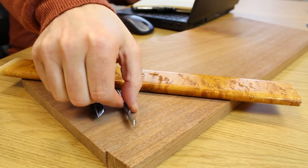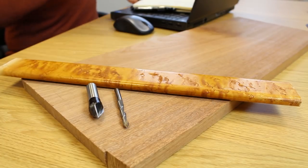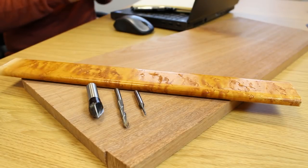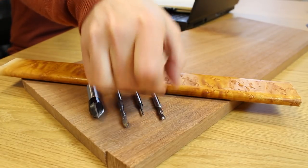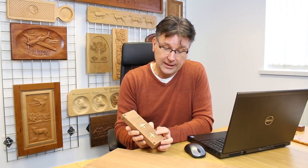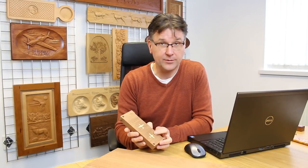There was a quarter inch ball nose end mill. There was a very small 0.078 end mill, and then also a 0.183 end mill. I highly recommend that you make some test cuts with your V-carve inlay settings. My first set of settings didn't work so great. The propeller went away, actually. I've got one half of it, but not the whole thing.